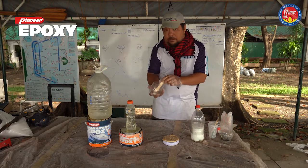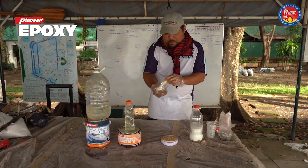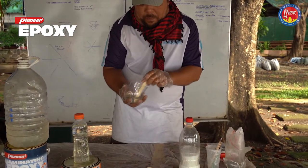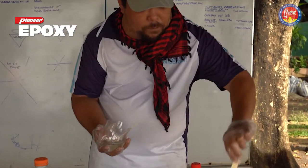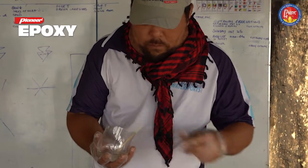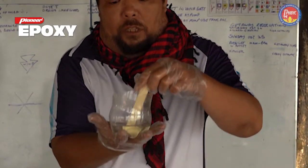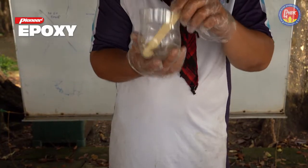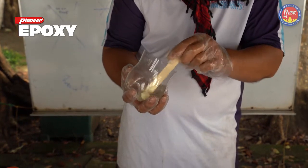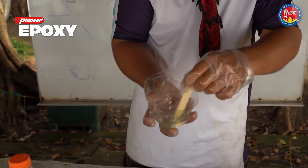First it will go cloudy, and after a minute or so of mixing thoroughly it will be clear again. For mixing sticks, we are using non-sterile tongue depressors, which you can get from your drugstore — already cut to the right shape, perfect for mixing epoxy. My mixing tub is a cut-off soda bottle; since the bottom has an irregular shape, make sure you get all the crevices inside.